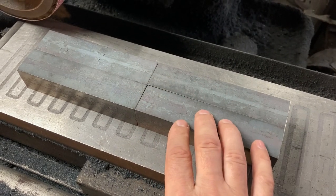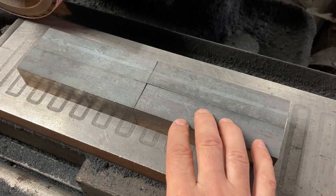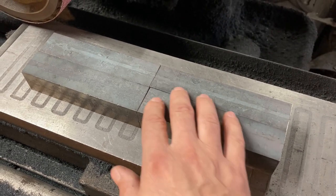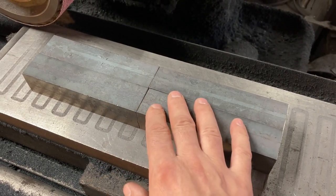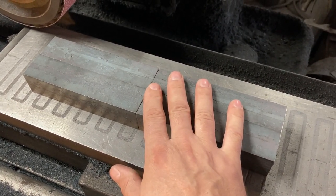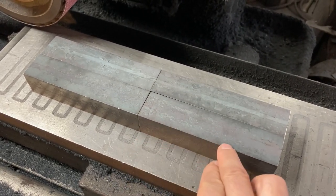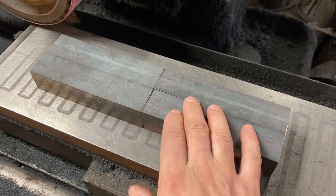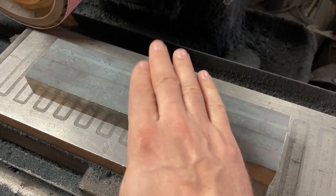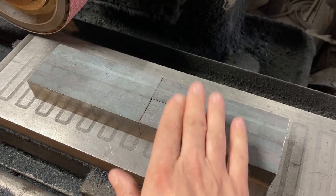The rolling mill acts as kiss blocks, but it doesn't push as much scale in as a press does. It's a little dirtier than the hammer, but it's more consistent than stop blocks on the hammer, faster than stop blocks on the press, not hard on your hammer, and it promotes even squarer edges than the power hammer does. So all in all, power hammer and then rolling mill to use as kiss blocks, because then you can like flip-flop it and run it through 90 degrees, flip-flop it, roll it back and forth till there's just no taper.